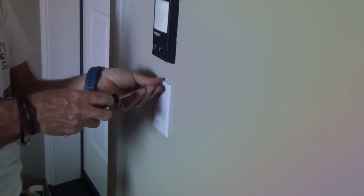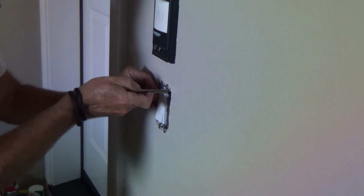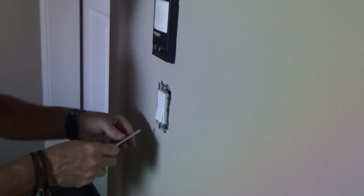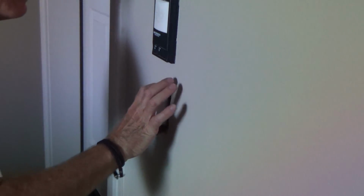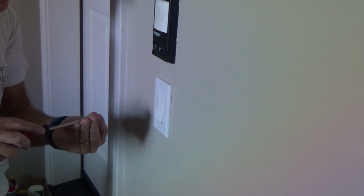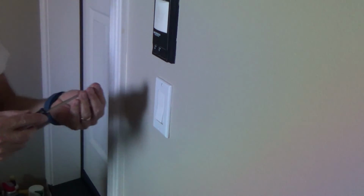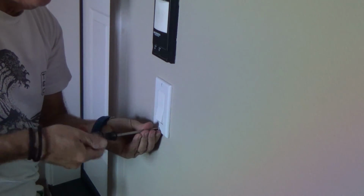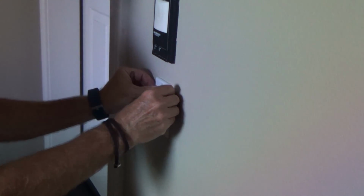Not very much. Maybe the door jamb trim is slightly off. I think I can do a little better. The top needs to go over to the left, just a little bit, just probably about like that. And see, if you have it just right, you could do it with that, or you may have to undo the screw a little bit. I just don't want to over tighten those, because that could suck that in. So I just make those snug. I don't try to over tighten those. As long as they're tight up against the wall, reveal looks pretty good.